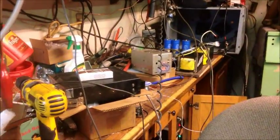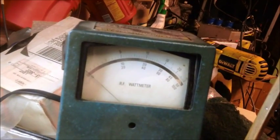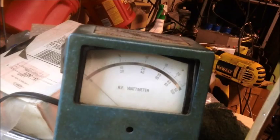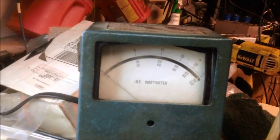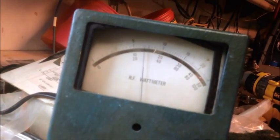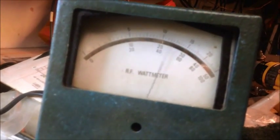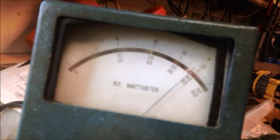Basically, over here I got a two-pill, and I'm going to show you what the two-pill's doing. We got a 500-watt slug in there. We're going to read the middle scale, where that 10 would be 100. The center slash in between 0 and the 100 is going to be 50. So we'll put about 25 into it, and for 25 into it, it's going to give us about 130, 135, somewhere in there. It's real close to 400 RMS. Not bad.